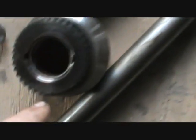Now, I guess I could show you the rear end of the tractor. I'm going to shut the doors. Actually, you guys might as well shut the doors because we're going to have rain tonight. But yeah, that's it. There's a few bearings, little bronze bearings here. I'm going to replace those for the simple reason that I've got this transmission this far apart. I might as well fix it up right.